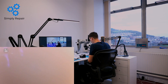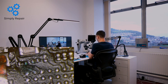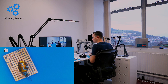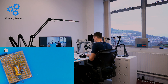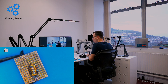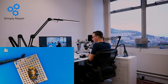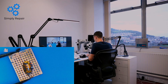So now we're going to put our UV lights on — just waiting for that to dry. So now we're going to re-ball the other chip. The reason I'm re-balling instead of replacing is because it's not the chip that's the issue — the chip isn't actually broken, it's just the connection to the chip that's broken. Also, you avoid any issues that a replacement chip may have, since they're usually not re-balled nicely. I've had IC chips that were a nightmare because they just continuously didn't work, and then I realized the re-ball was terrible. So I do my own just to avoid further issues.